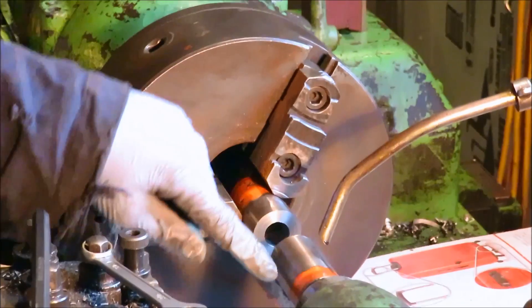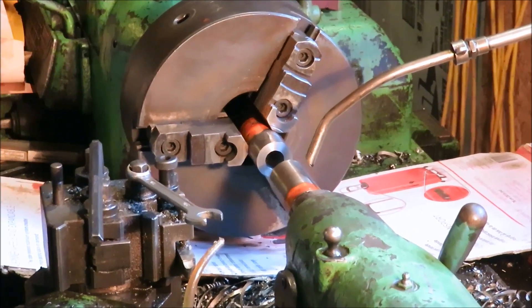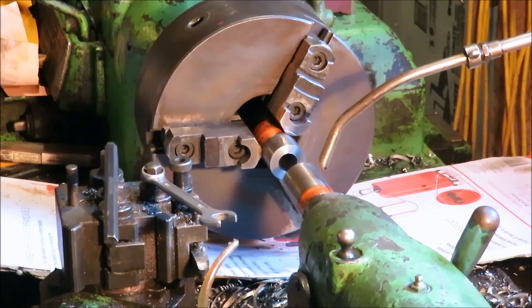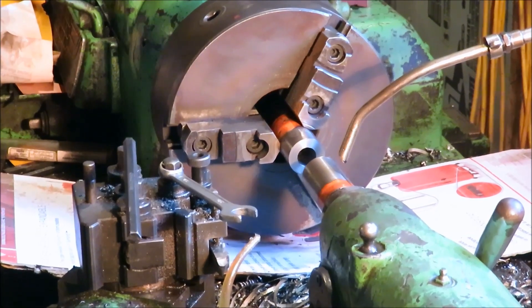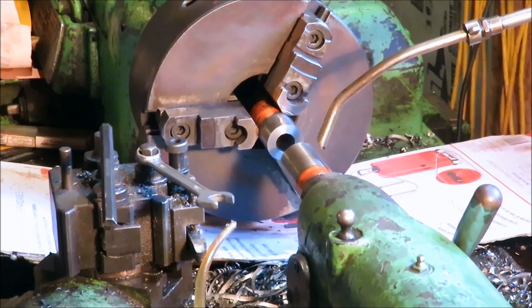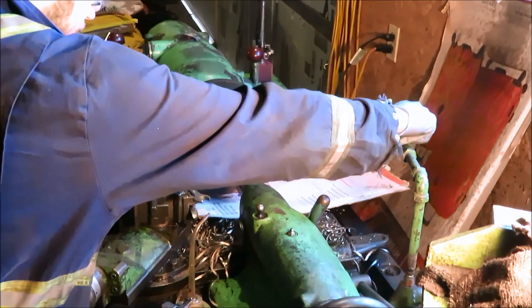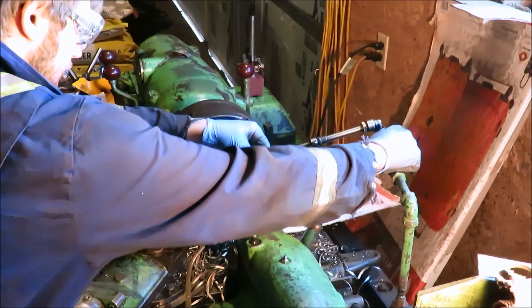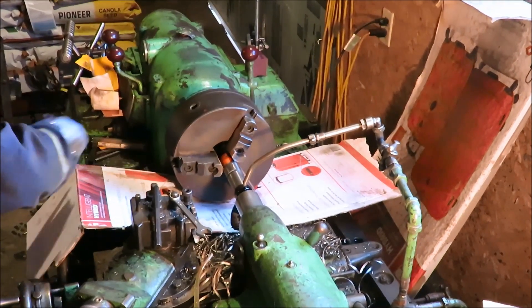I have this coolant setup so I can cool down the non-rotating piece, because since it's a Morse taper, when it heats up it's going to expand and I don't want it wedging itself really tight into the tailstock. I'll try oil — I wish I had coolant but oil will be okay. This is the non-rotating piece so I don't expect it to fling everywhere. That'll just run right down into the sump.